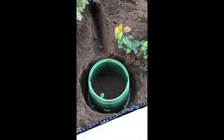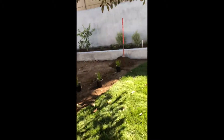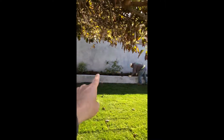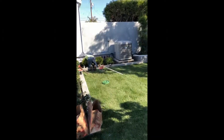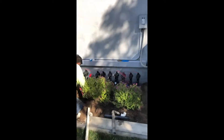We're going to be installing our adjustable pressure regulator in this 10-inch round valve box right here with a meter on it. On this job we're going to be going head-to-head with Netafim. This side of the planter is all going to have Netafim up to where our system starts, and then from here over is going to be RDI grow stream tube. They already had the valves installed and Juan at Streamlight Landscape wanted to do a comparison with our new technology.